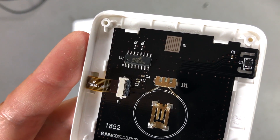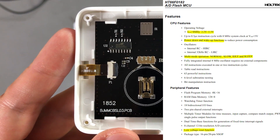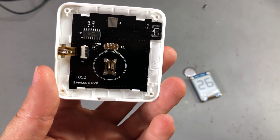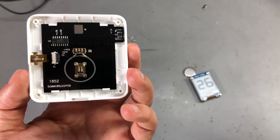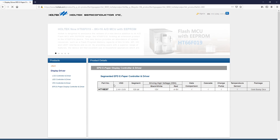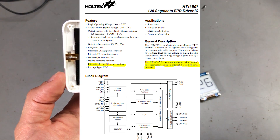On this PCB we know they are using a small 8-bit Holtek microcontroller, part number HT66F0182. I know Holtek also makes a bunch of display controllers, so it might be worth checking if Holtek makes any ePaper display controllers, since it would make sense to get the microcontroller and the display controller from the same manufacturer for a better overall deal. A Google search for the keywords 'ePaper segment Holtek' gives exactly what we're looking for — it seems Holtek makes a driver chip with part number HT16E07, designed for driving ePaper segment displays with a convenient SPI interface. So it's likely the designers chose this display driver from the same manufacturer.